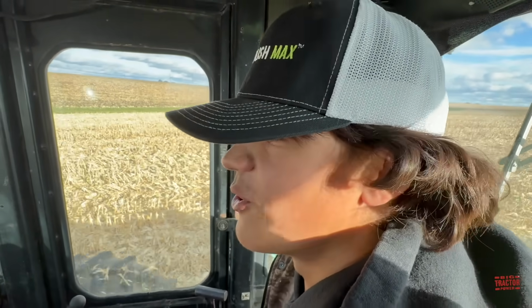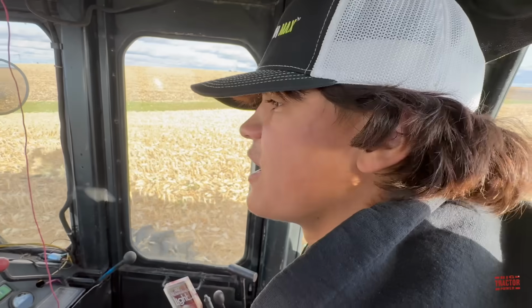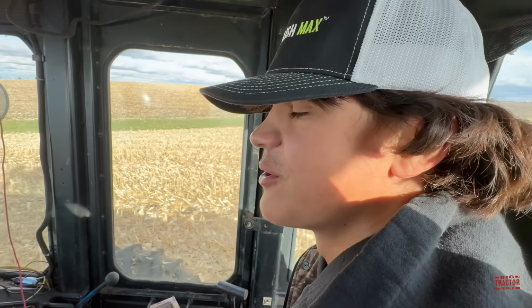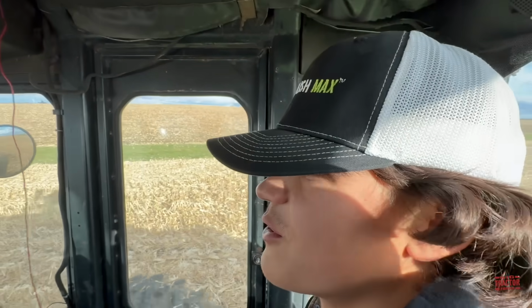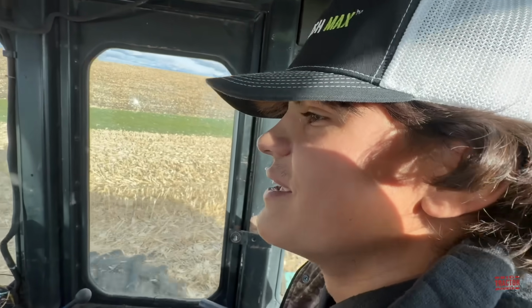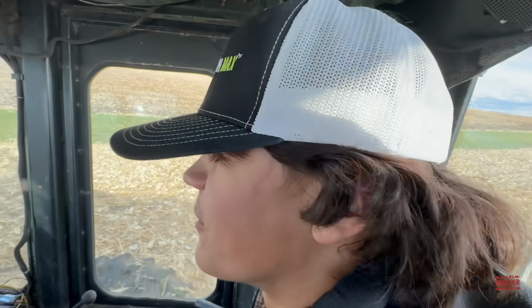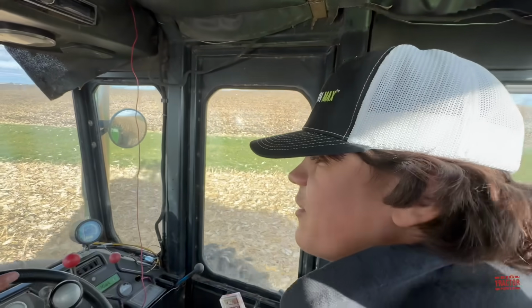Yeah, absolutely. I love this whole tillage crew. We've been working on it for about a week, getting a lot done running 3 units. So this tractor specifically, like previously said, it's a Cougar 3 ST270, repowered with an 8V92 Detroit turbo, rated about 500 horse, I'd say. That's a big jump up from 270. Yeah, needs a bigger clutch. So they used to eat clutches back when they first put this motor in, because it's still the same 20-speed transmission that they put behind the 3306. So it's got a heavy clutch in it that can hold the power. It's been a good tractor to us.